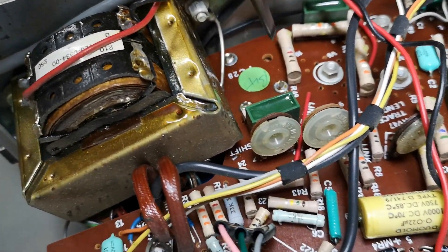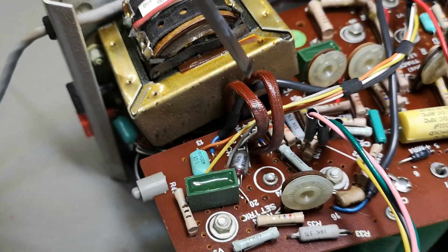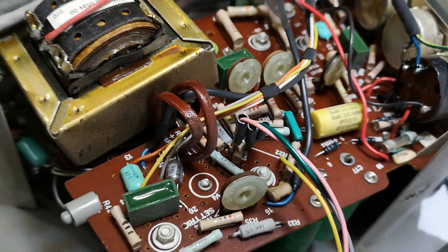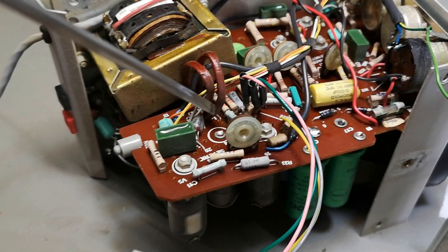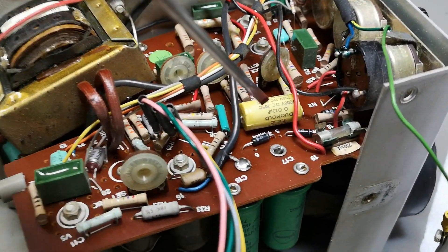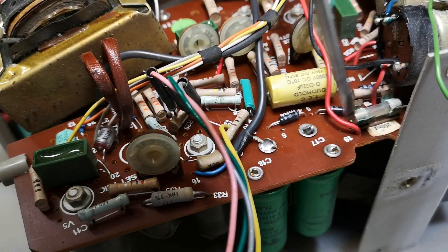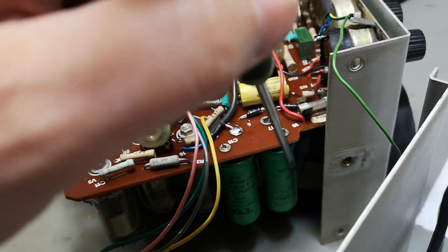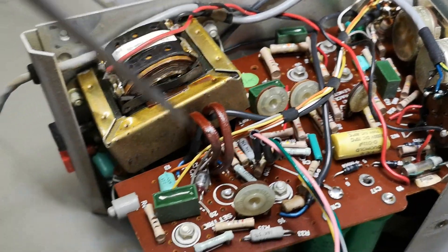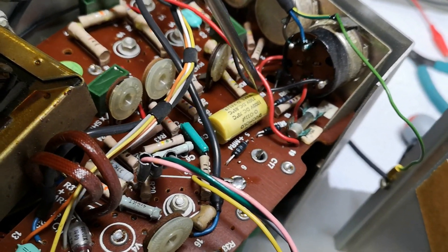I need to know exactly what is written on it voltage-wise before I measure. I'm a little bit skeptical when it comes to CRT stuff — I know this tube is not running at very high voltages, but it's a good idea to know what you're doing. Just don't poke around with your voltmeter anywhere randomly because you can destroy your voltmeter. What I see here is high voltage diodes, and those are probably in series. So that will probably be the anode voltage running at 450 plus, or times two. This is a thousand volts.